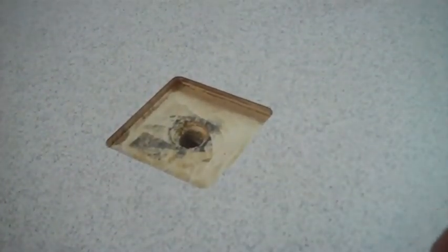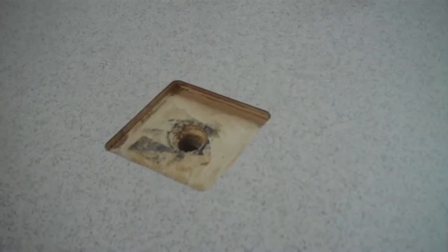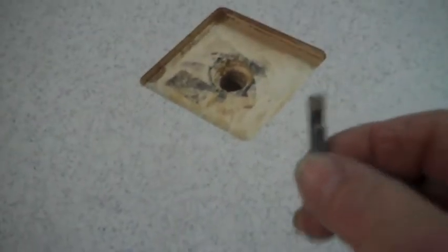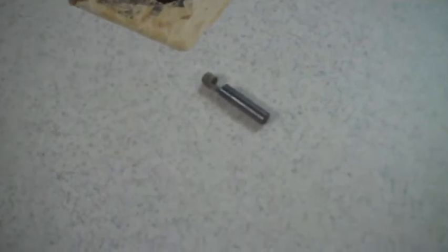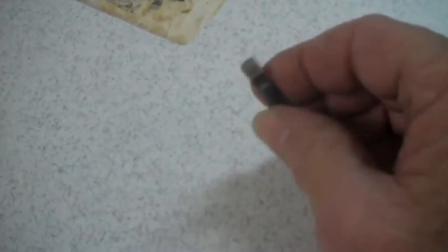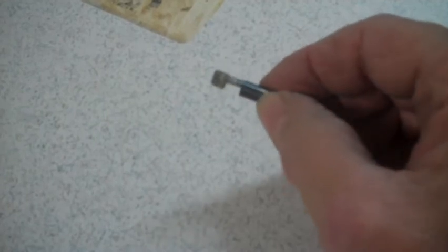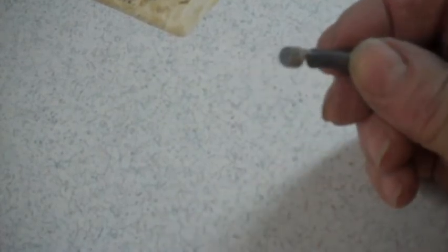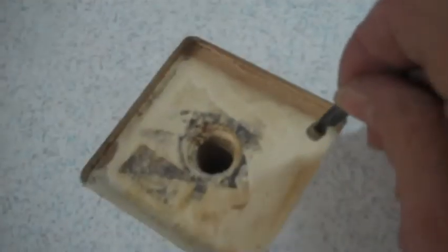Bob, after getting the laminate on, I already had pre-cut this square hole in here. And probably I should have put the laminate on before I did it, but what I did to fix that is this bit is one that Dewey Mitchell ground for your dad and I at Carpen Grinding. It's solid carbide, and it's one of the first laminate trimmer bits. And I had to grind the bottom off because it had a rounded bottom, so it actually fit down all the way to the bottom, but that's what trimmed this out and did a very nice job. Okay, so we got the Formica on the base piece now.